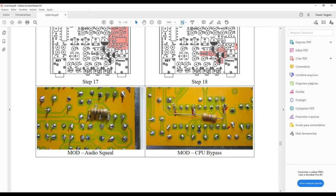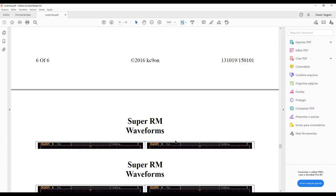They have here some instructions for audio and so on, which is, if you want to bypass the CPU, it's possible doing this. But remember, as I told you, you have to provide some way to return the PWM frequency of your manipulation. Otherwise, you cannot hear. And it's not good when you are transmitting to not have your own feedback of your transmission. But this is not necessary if you want to assemble the circuit that I will show you.